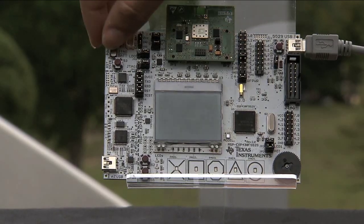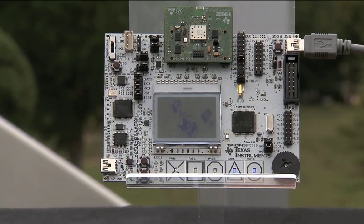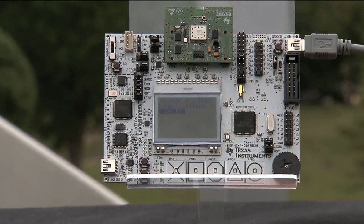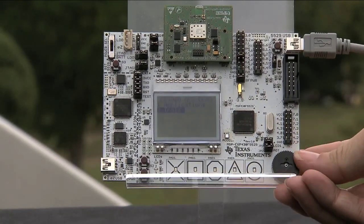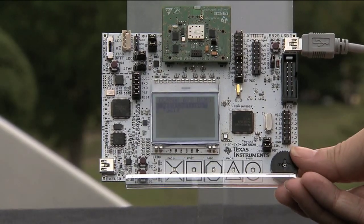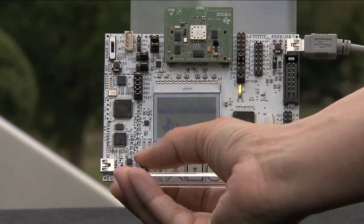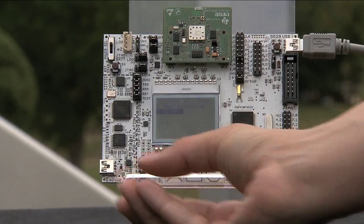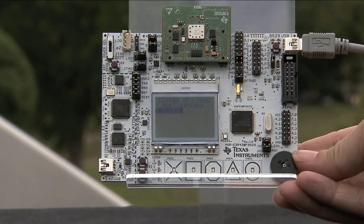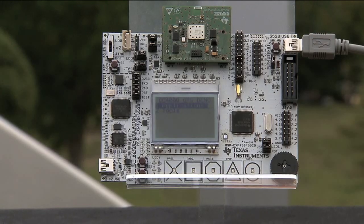Let's run the user experience code. The experimenter board is connected to the laptop for power. When you turn on the experimenter board, the TI logo with animated GPS satellites shows on the LCD. You can select S1 or S2 to go into the main menu, which has two submenus. The analog thumb wheel is used to scroll up and down on the menu, S1 switch selects the current option, and the S2 switch is used to exit menus. This demo application allows a user to observe common GPS parameters directly on the LCD of the MSP430 F5529 experimenter board.